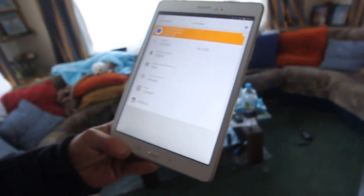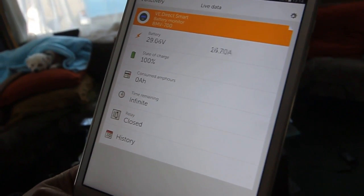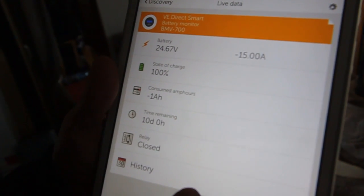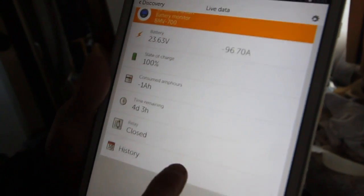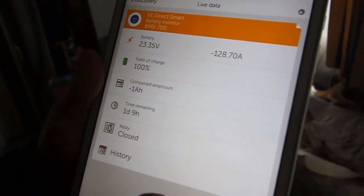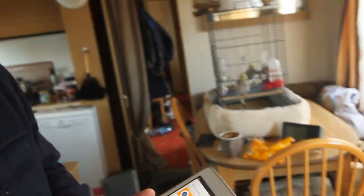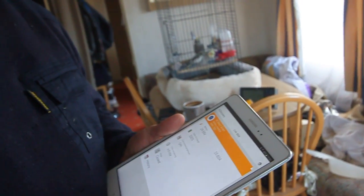Washing machine, boys! Washing machine! Yeah, it's up to 23, look. 21. Ooh, 20 amps charge from the battery and solar. 26. Battery voltage, 28 volt. Right, so the washing machine takes 140 amps whenever the immersion heater kicks on, and that's probably 125 amps, 130 amps, and the overload alarm. Victron will go 3 times overload, and that's it for him. Then you need to restart manually.